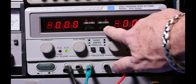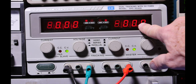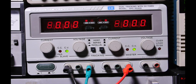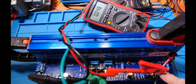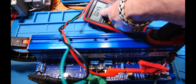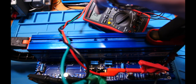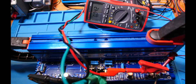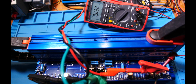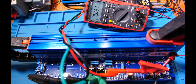These switches allow me to see amps or volts on each side, so I'll watch volts on one side and current on the other — that way I can monitor both at the same time. I've got leads across the 47 picofarad capacitor and a meter reading voltage. We're supposed to get four or five volts across that capacitor, and there's a little pot I can adjust to tweak that in. I want to be able to see the LED, which is right here.